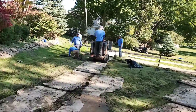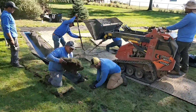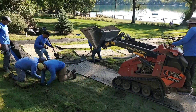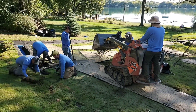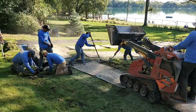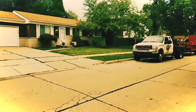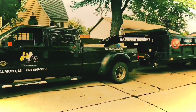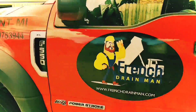What's nice about not having inlet basins on your French drain is you're not going to end up with any contamination in the system. If you put catch basins on a perforated pipe, you're going to bring in contamination and it's going to fill those perforations. If you found any of this information helpful, give us a thumbs up — it supports our channel. If you have any questions about a French drain grid or putting in a French drain field, leave them in the comments section.